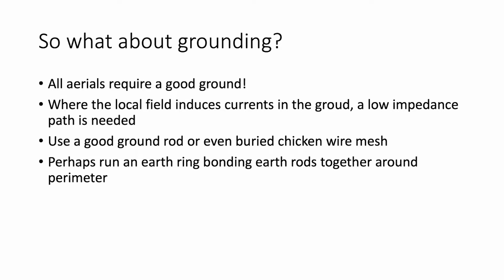And there was me under my aerial. I had a 15 meter by 15 meter steel workshop roof. So I got the angle grinder out, and all along the edges I cut little tabs and wound copper wire around and right the way around to bond all the sheets together back to my aerial matching unit. And then I also put earth rods around the place and vertical wires down into earth rods into the ground to make as good an earth as possible.